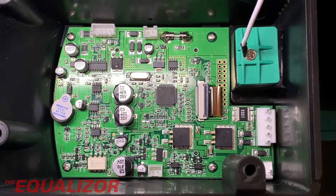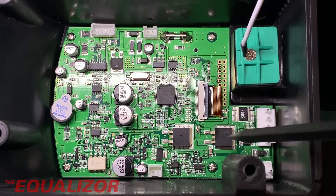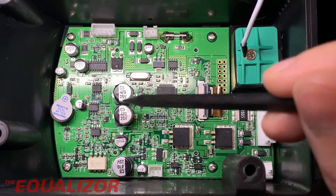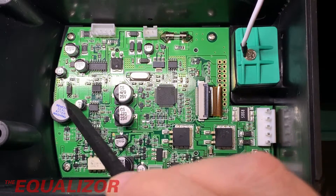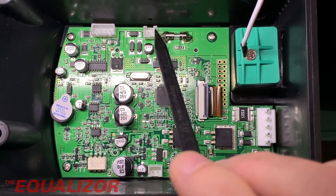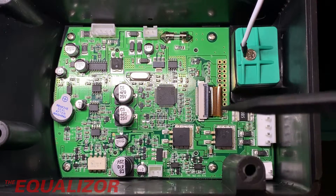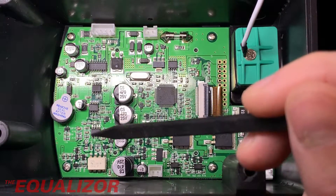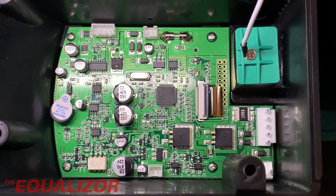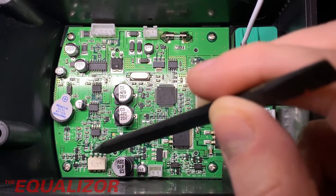There's not really an awful lot to this board. The microprocessor down here is an STM32F103. There are a couple of switching MOSFETs here, and this is where the display connects. We've got some caps, a buzzer — somebody's left that thing on, which you have on for reflow soldering so you don't want that getting inside. Over here we have the connection for earth and the transformer connection, a fuse bodged on there, and some op amps to amplify the signal from the temperature probe inside the tip. And this over here — I'm not sure what that is, but it looks like an opto-isolator of some sort.